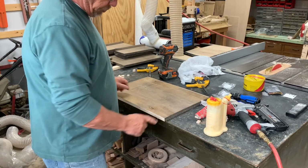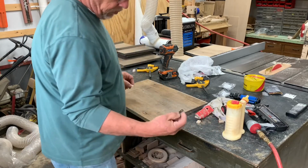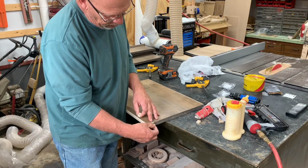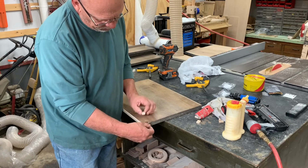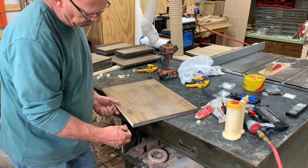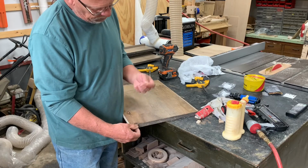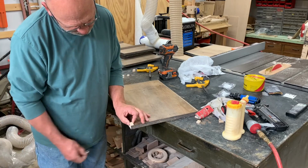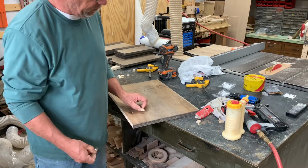Here on the back of my shelves, gonna add a little block here. Whenever you use these pins, I did kind of drill mine kind of forward to the back. If you get them too far up, then the shelf can tilt, and I kind of put mine a little bit too far back. The problem with too far back is, if for some reason you have to grab the shelf, the slide, it'll fall out. You can put a little screw. These are made to put a little screw in here every time, but that's kind of a pain if you want to readjust all the time. So I'm just going to put a little piece of wood back here with the screw in it, like so, and that'll catch it from falling out.